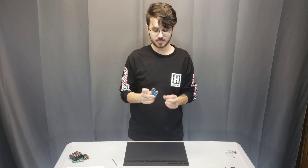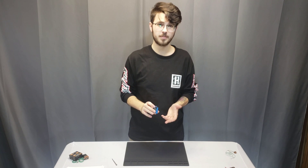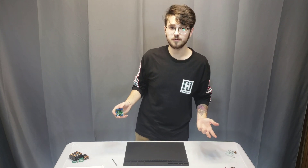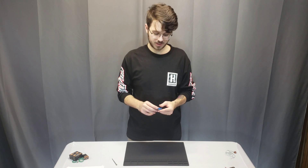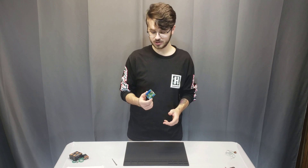It also has a microSD card reader. By default this has four megabytes of storage on the board, which is equivalent to around four minutes of MP3 sound files. But if you want a longer sound file, this board supports up to a 32 gigabyte microSD card, so you can fit hours of sound files on this module.